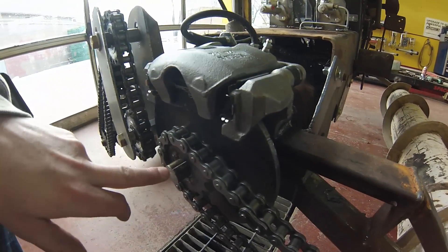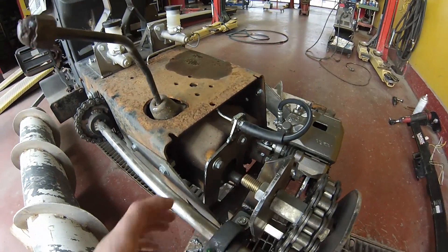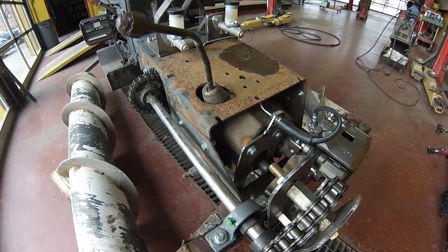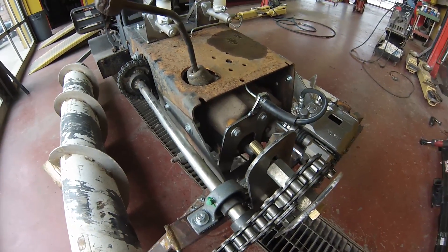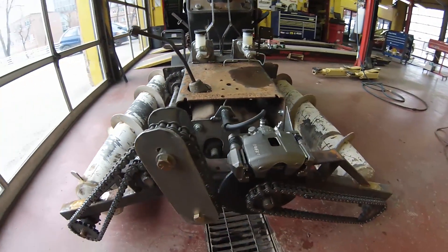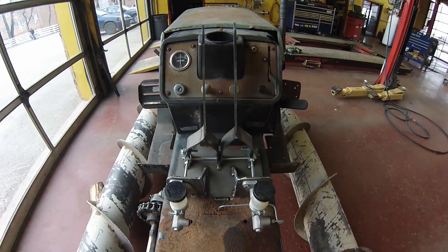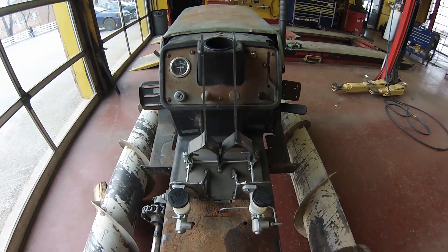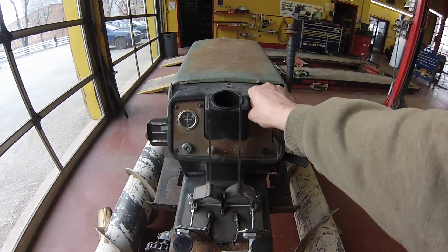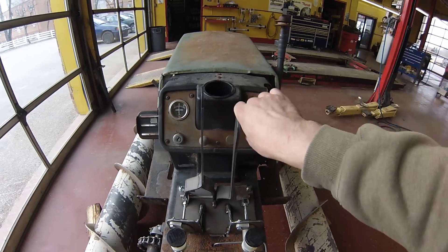That's how the brakes are operating off the shaft. I plan on putting another sprocket in here for the second caliper, and that's going to brake the left-hand side of the tractor. These levers will be between your legs when you're sitting, and I'm going to have some bars coming off here to pull from, basically the same as a regular dozer or something.